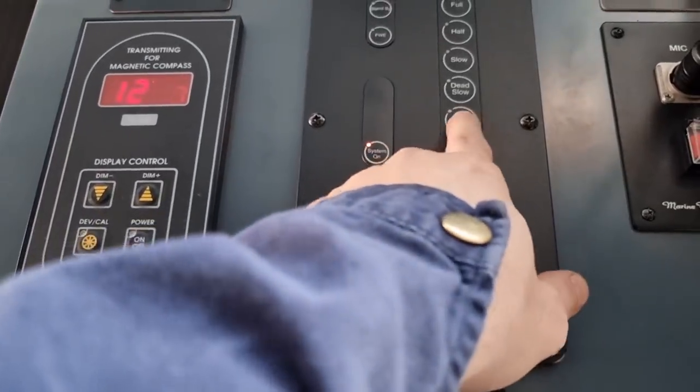What I am going to do now is ask the crew to stay there, then give a stop command here. He needs to acknowledge and press stop also, then we will power off the system together. I'm thinking that each unit has a different command stored in their memory — they have different last commands. So to correct that, we need to put the stop command here, they acknowledge it there, power off the system so that the last command stored is on stop on both sides, then power it back on. I hope this sequence will work before we go to the hardware side.